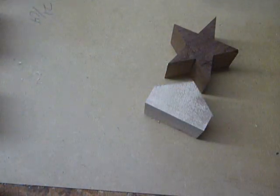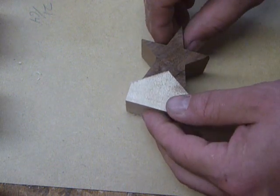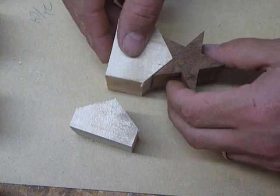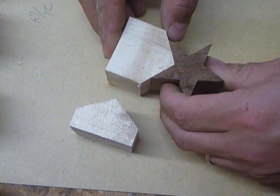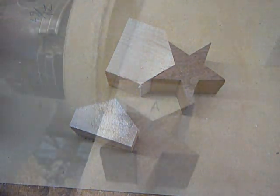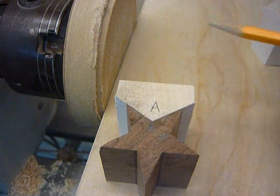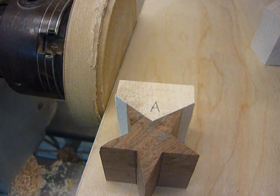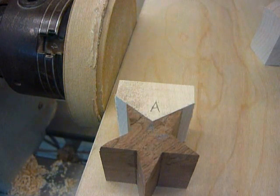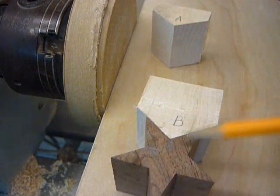Now that our maple's cut, we need to finesse the fit and get all these pieces to fit as tightly as possible. This one came out very well — no gap, no wiggle at all, so that one is ready to go. But this other one has a bit of a gap and a wobble, so we're going to take these over to the lathe where I have a sanding disc set up and finesse them until they fit just right. As we sand each piece, we want to make sure that we label them so we know exactly which slot each goes back into, otherwise a piece we already had sized won't fit right. Each one is likely going to require a slightly different method of sanding.